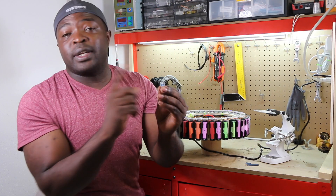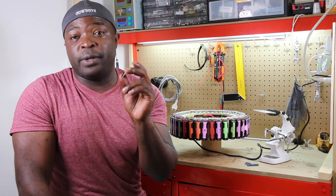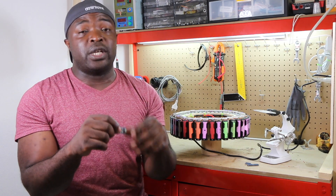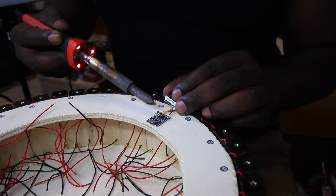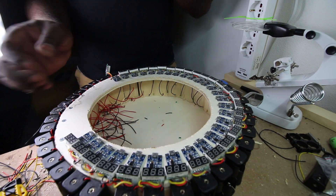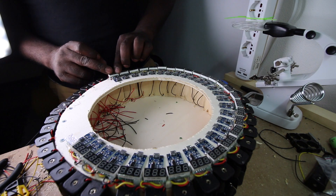We are going to take some cables and solder them directly onto the positive and negative here. That is what is going to supply power to our TP4056 charging modules. The black and red cables from the cell holders go directly to the output of our TP4056, soldered together with the wires from the battery monitor. Then we glue the whole thing to the box we created, which looks nice.